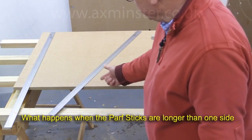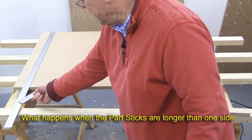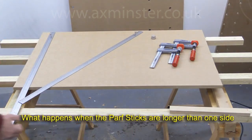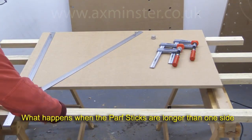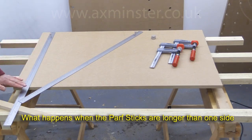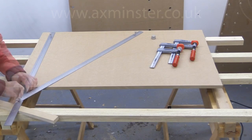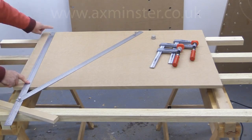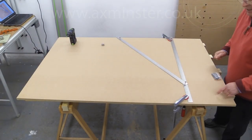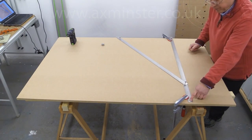To illustrate what happens when the endpoint of this rule and the 8th point on this rule is not on your surface — it's not a problem. All we do is make sure that this end is supported and count down: 1, 2, 3, 4, 5, 6, 7, 8 units — line these two up precisely, and with that pin in place we can clamp here and clamp here. That is a perfect line-up. Clamps are nice and tight, so the very first thing I'm now going to do is drill a hole just here and put a pin in.